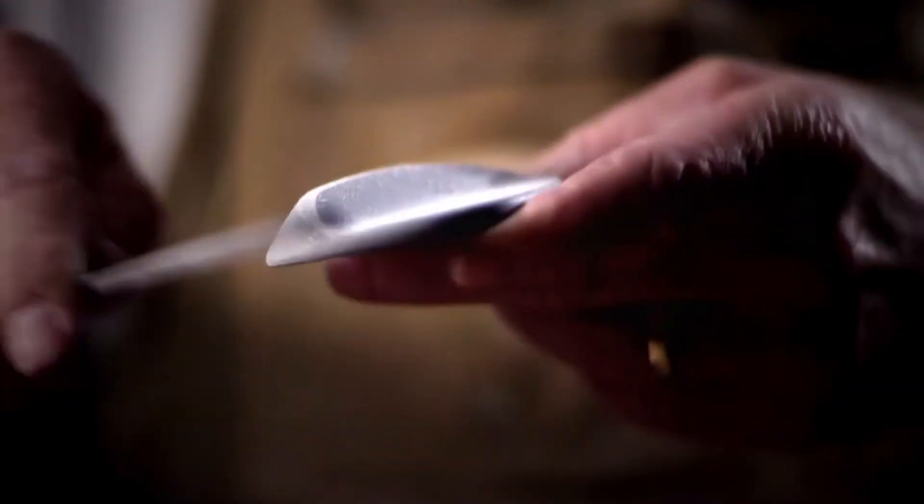We know that our competitors hand polish. People think it's got to be better, it's handcrafted, but it's simply not — it's actually a detriment. You have a line of 10 to 15 operators hand polishing these, all trying to make them identical to each other, and it's simply not possible. You can get a 60-10 wedge and a 60-10 wedge, and the consumer expects them to be the same, but in reality they're probably not. There's just too much variation in that hand polishing process. There can be a flat spot on that sole, the leading edge could be asymmetric — we just know that it's not going to be consistent.